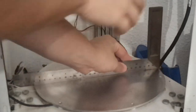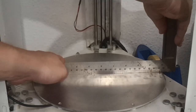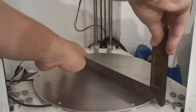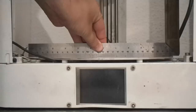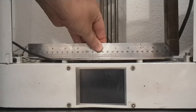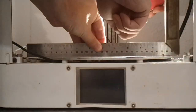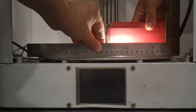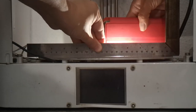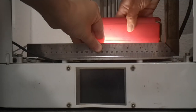My bed is 26 centimeters in diameter and it's not flat. When the 3D printer came from the factory it was set up incorrectly, so it smashed into the bed and bent it. I'm asking the wife to help show how much light comes through - it's not a whole lot, but a 0.2mm difference will actually make the prints not stick and they'll just fail midway through.